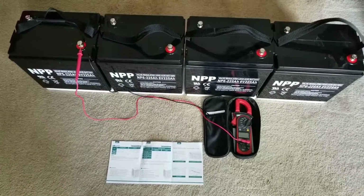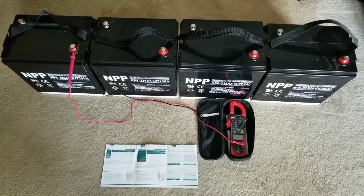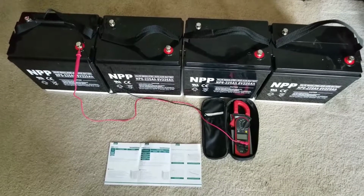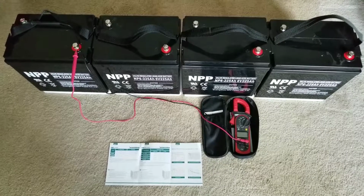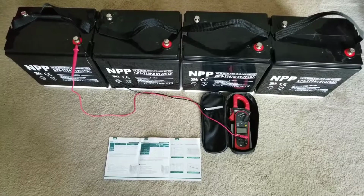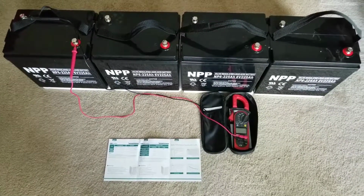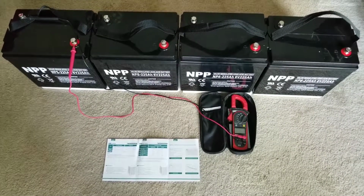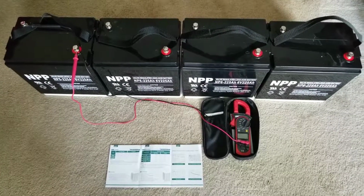If I'm gonna get those other batteries coming in, then I'll just keep it probably on 24 volts, and I end up getting the other ones, the telecom batteries, just for the 48 volt system. If I go telecom, then I'm gonna go with 180 amp hours battery each. Then that will make it easier. If I got 2 strings of those, 180 times 2, it's not bad. So 360 amp hours. That's good.